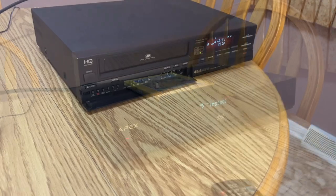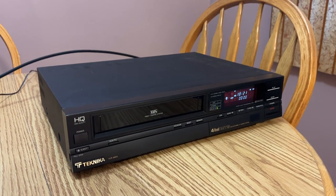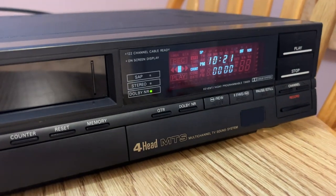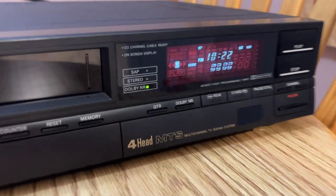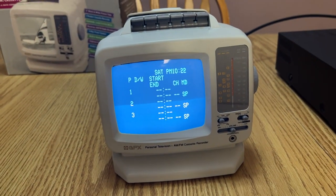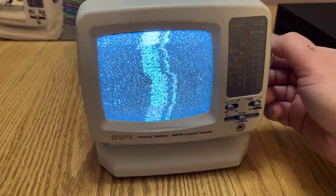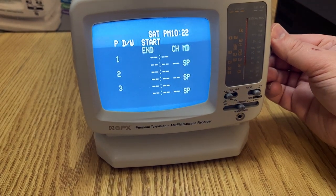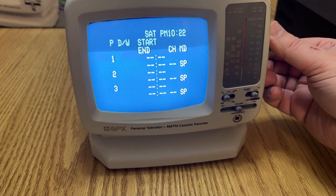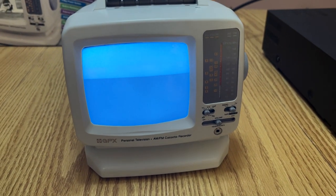Let's try the tuner now. I brought out the 1988/89 Technica OEM Funai - before 1992, good Funai made in Japan, heavy, well built, nice VFD. This is the linear stereo Dolby version, a very nice machine. I'll pull up the program on here. I'm again surprised - and it looks like the TV tuner actually does mute the audio off the station. You go off, that audio disappears. Putting it back on, though, bright text does buzz - could use a slight IF alignment, or it could just be the nature of that jungle IC in there.